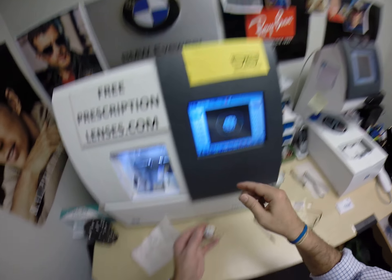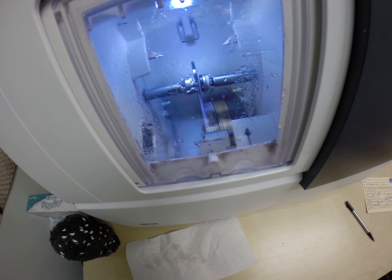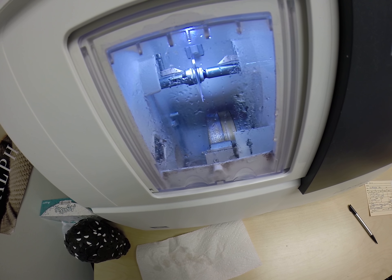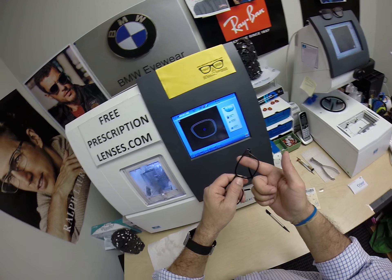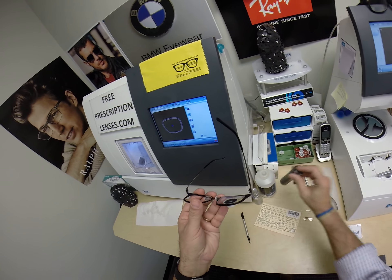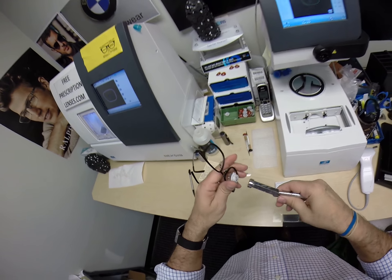Let me flip this over to L. Press that on there firmly, put that in there, and hit start. The door closes, the clamp shuts. The lens will be traced by the two white styluses, making sure that it's large enough to fit. You can see it's just tracing the shape of the left side of the frame this time. And just like before, measuring the thickness of the lens to know exactly where to place the lens so you have the least amount of edge thickness showing — of which you got none. You got nothing, you got nada, niente.